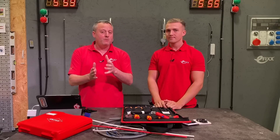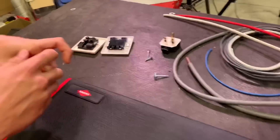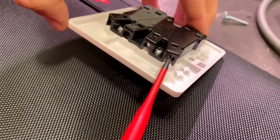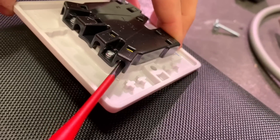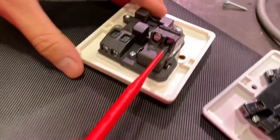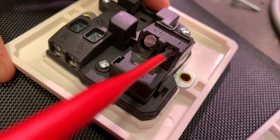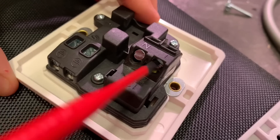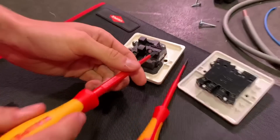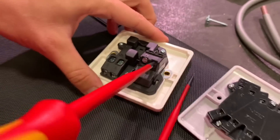Shall we demonstrate where a student might fall down? So we've got the 3.5mm — look at that, it fits perfectly in that slot on the switch, perfect for those light switches. But what happens is they tend to use the same screwdriver again for the sockets. It does work, but the problem is the termination will not be tight enough, because it doesn't take enough of that area up in the slot. So is this where the 5.5mm comes in? That's right — you can clearly see that's got all of the slot, and obviously we can get a tighter termination.